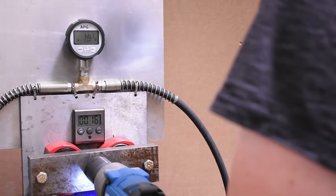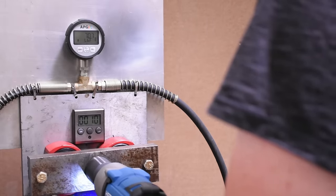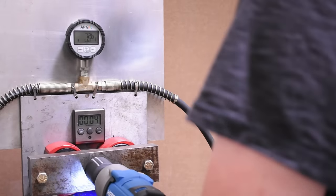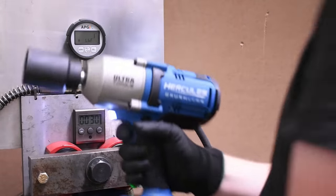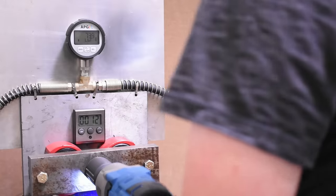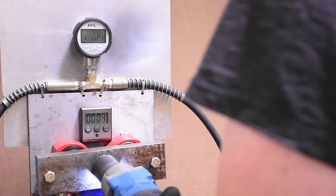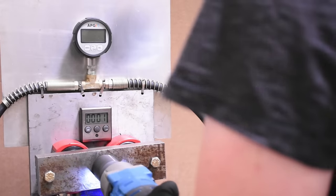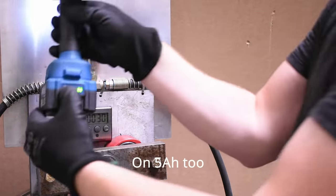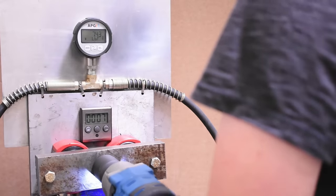For one, it doesn't sound very happy. This is how a DeWalt sometimes sounds for us as well. But mainly in the 30-second test we see what around here we call speed wobble — basically a feedback loop of vibration, more of a precession that causes the tool to basically swirl around violently rather than stay in place and impact. This doesn't always happen with all cordless impacts but is not rare on a long test like this and can even happen with air tools as well. The ultra torque as we're showing here is not exempt to this phenomenon. We've seen this from many other brands too, including Milwaukee on their mid torques, and this happens on a traditional Skidmore Wilhelm torque testing machine as well.